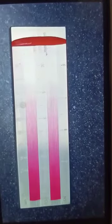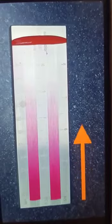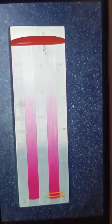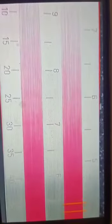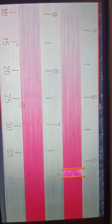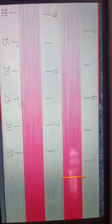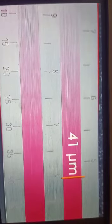If you're using the Elcometer 2020 or Elcometer 2050, look at the deep end of the gauge and move to the zero, and find a band across the channel or channels that's 3 millimetres or an eighth of an inch wide, which contains 5 to 10 particles of the material. Once located, read the position of the upper limit of this band on the scale, and record the value.